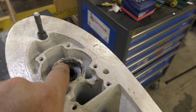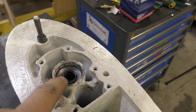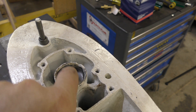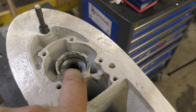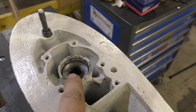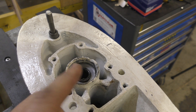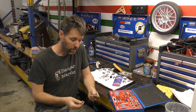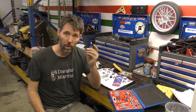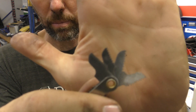It's worth mentioning these seals I pushed in — I didn't have the Evinrude custom tool that sets the depth, and they look like they're in a bit too deep. I've had a good look with the torch and the bottom one doesn't seem to contact the roller bearing, so I'm not super worried. Fortunately they're not hard to change down the track if needed. This is an Imperial tap and die set, being an American motor. This is the bolt that came through, so obviously this is the thread and diameter we want.